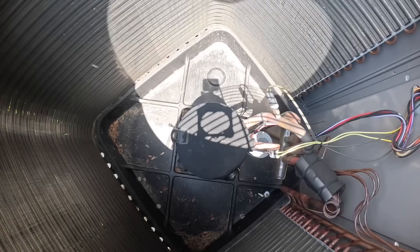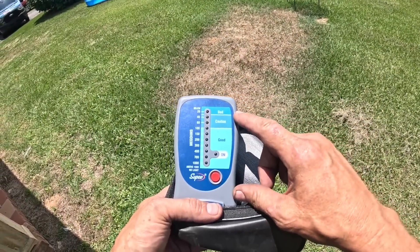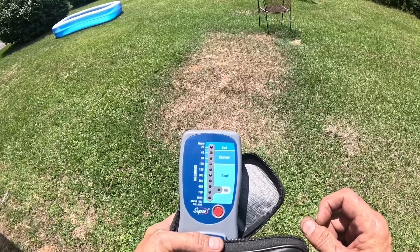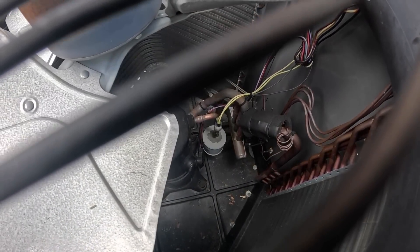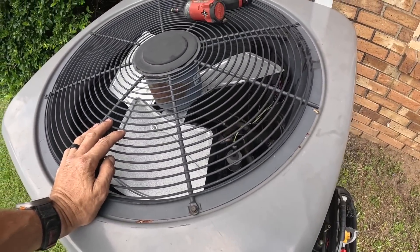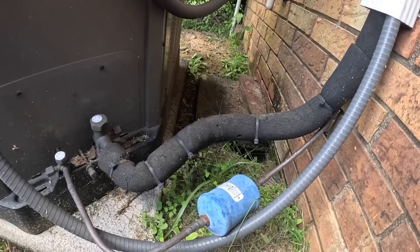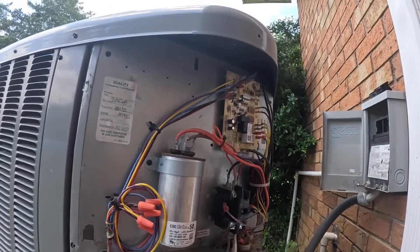I'm going to get my meg out. I don't need to check it with this but I'm going to show you. Basically anything below 20 or 30 mega ohms is going to be bad, and I was reading 3.2. It is really tight quarters to try to get a suction filter in there — no good spot. Because this is the cooling season, I may just put one in right here and tell them we'll have to come back and remove it. Looks like we're going to be doing a compressor in the coming days.